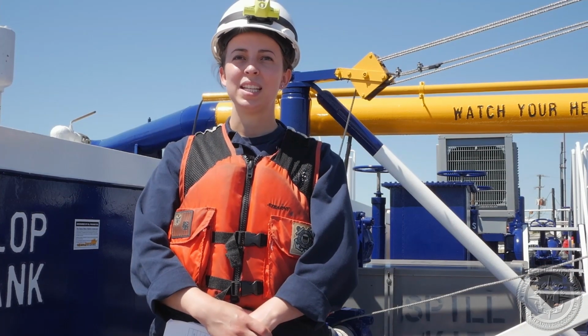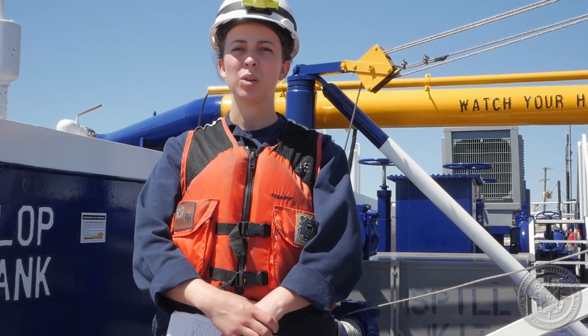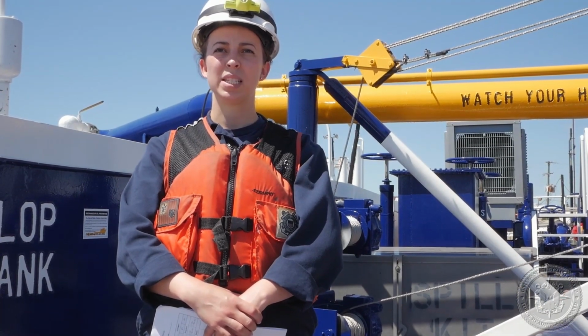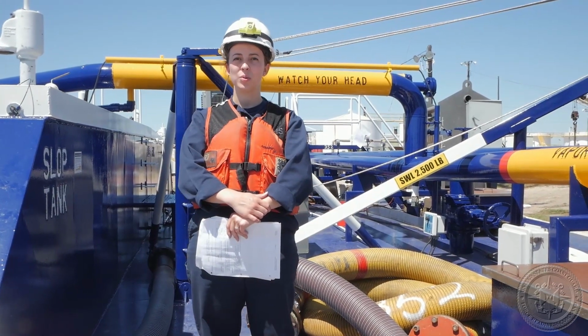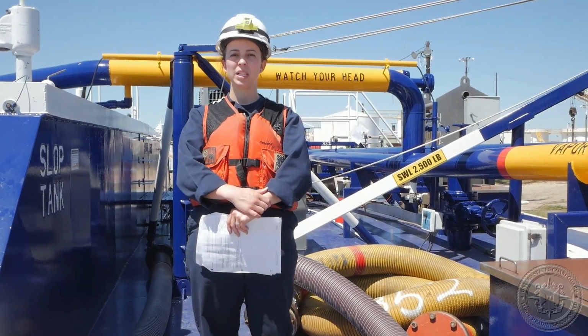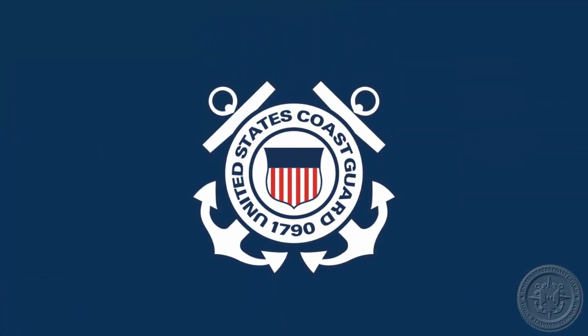All inspections and maintenance that are conducted on cargo hoses and cargo piping need to be documented, and those records need to be maintained for 3 years. The date of manufacture for the hose also needs to be available, but it doesn't necessarily have to be stamped on the hose itself. The maximum allowable working pressure of the hose must be labeled or stamped on the hose, but the maximum allowable working pressure test can be recorded elsewhere.